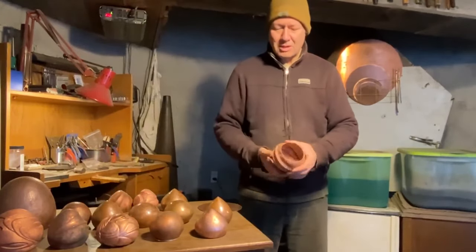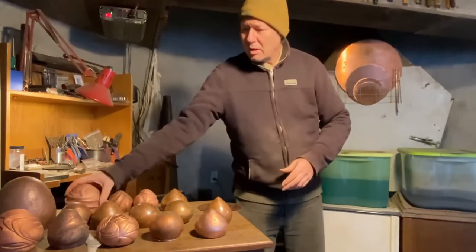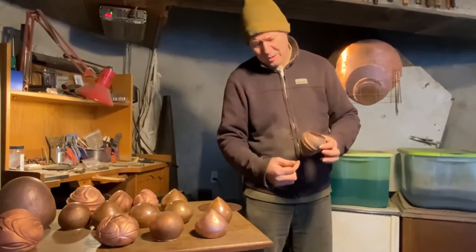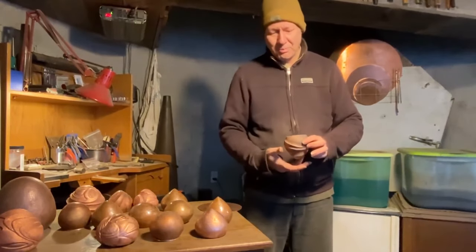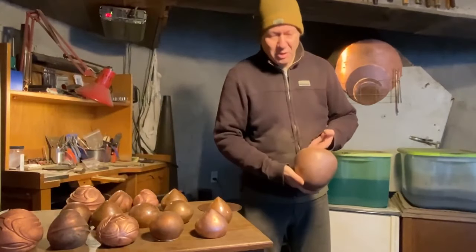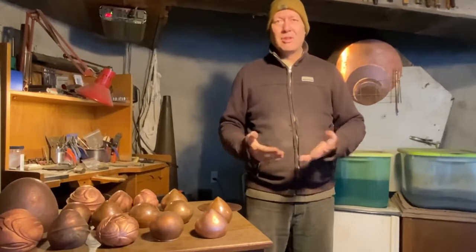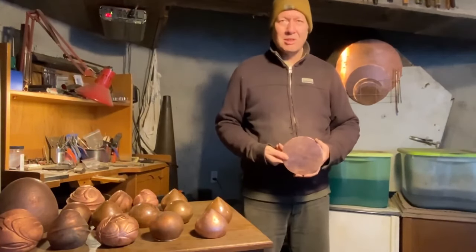whereas this one is an example of an 8-inch disc, so it's probably about 4 by 4. Here, this one is a 7-inch disc, so I'm guessing we're probably about 4 by 3-ish, somewhere in there, 3.5 by 3.5. This one's a 12-inch disc, and it's a rule of thumb. It's not dead on accurate. You know, give it a 1/4 inch, 1/2 inch, either way. But that just helps you if you're actually shooting for a particular size to know what size disc you want to start with.